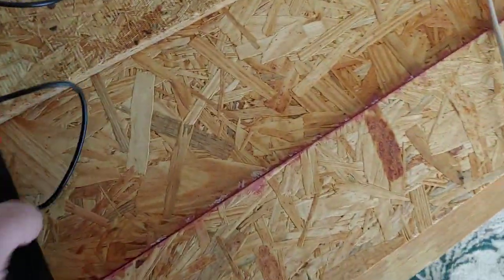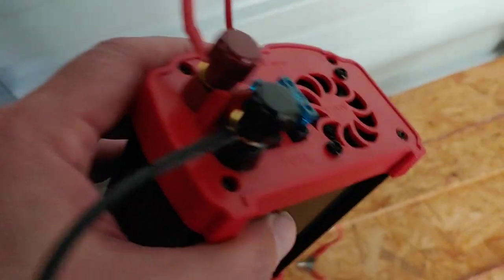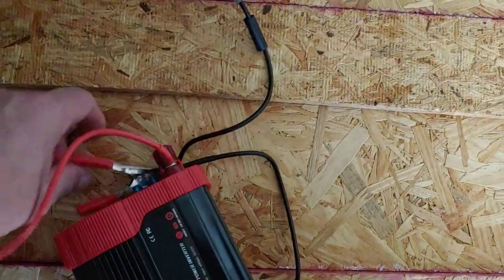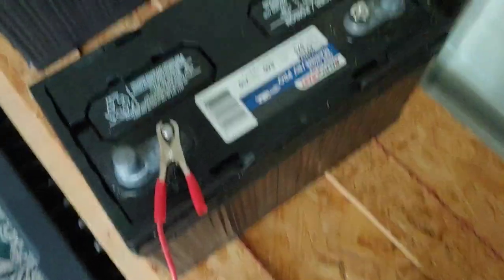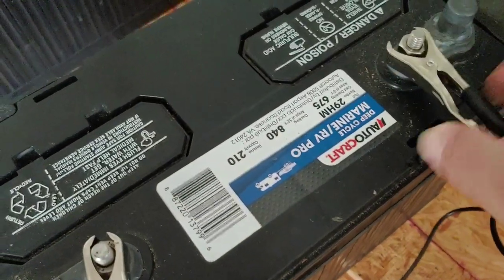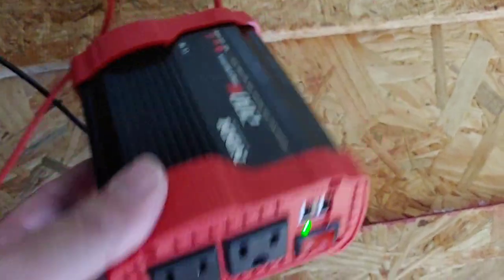Okay, so let's go on. What we've got now is our little inverter, which I've already hooked up. I have already done a video on how to hook these up — I'll put that link in the description too. They're really quite simple; anything is simple once you've done it. The red and the black are connected. We're going to take the red first and connect it right there to the battery, then take the black. Sometimes you'll get a little spark — don't worry about it, those things happen. It is now connected black to black, red to red. Make sure it works — put the little inverter on. There we go, turned on. Green light — it's running.